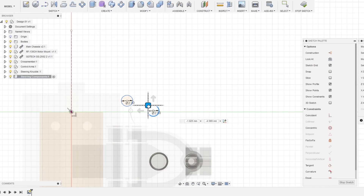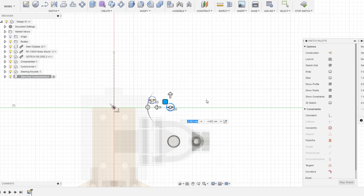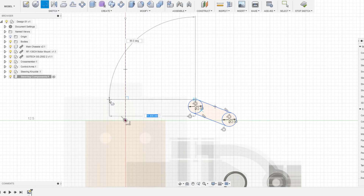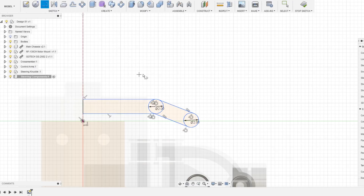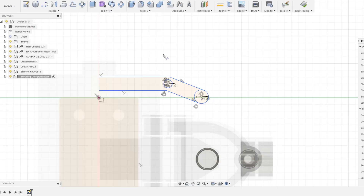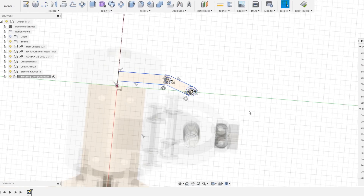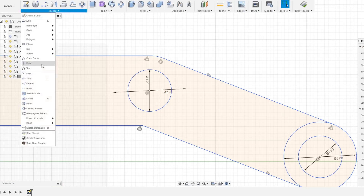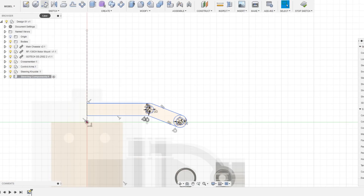With that progress made, I began working on the steering. I often find the steering system to be one of the more difficult parts of the design. A typical steering setup found in just about any RC vehicle usually contains quite a few moving parts and is almost always operated using a servo with some kind of arm attached to it, as will be the case with this vehicle. Because of this, it's usually quite difficult to make a compact and scale-realistic appearing steering system.